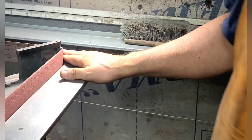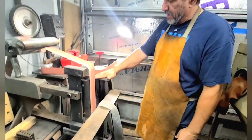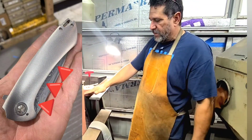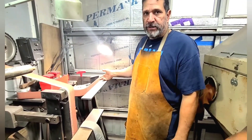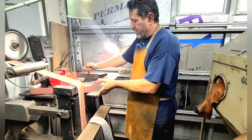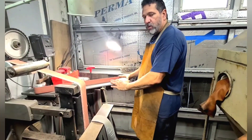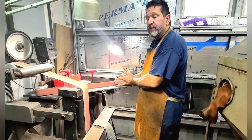And that's so you can actually make some curved areas too as it comes around the corner? If I am contouring a knife in the back, I can run it a little bit out and it will give me a 90-degree area right here in the front. And that's for smaller choils. And I can rotate — that's where your choil is right there — so I can work with the small wheel. That's amazing. And I have a more stiff angle. That is so cool.